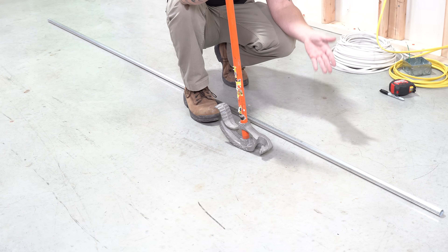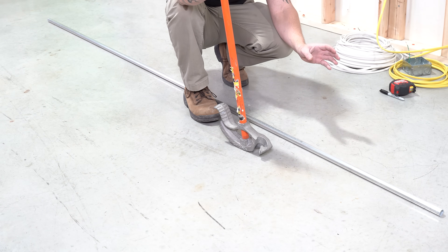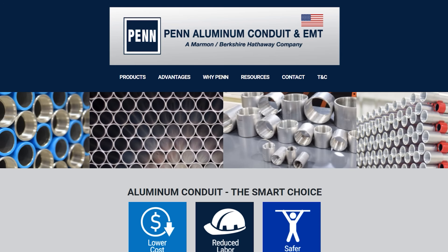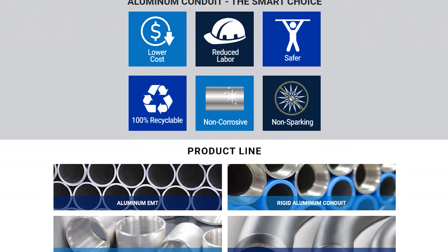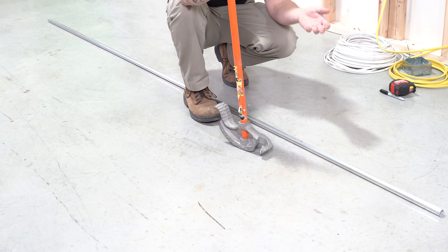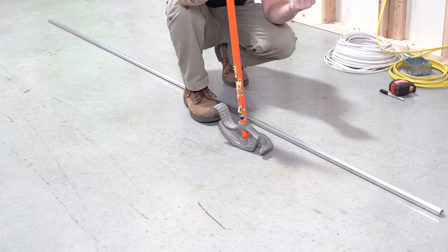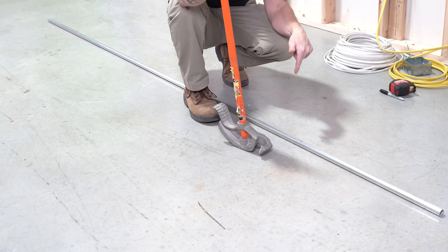There's also the pulling of wire through steel versus aluminum. Usually pulling wire through steel is a lot easier than aluminum, depending on manufacturing processes — aluminum has a little more rub to it, so there's going to be a little more friction when pulling conductors through. But this was sent to me by Penn Aluminum. All they make is aluminum conduit — aluminum rigid and aluminum EMT. They actually put a special coating inside called Blue Lightning, which applies a sort of Teflon coating on the inside of the conduit to make pulling a lot easier. If you're interested, there's a link in the description below.